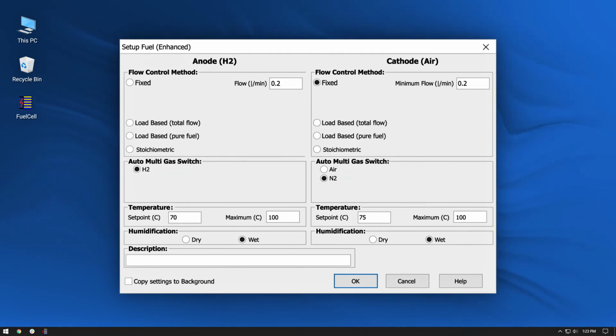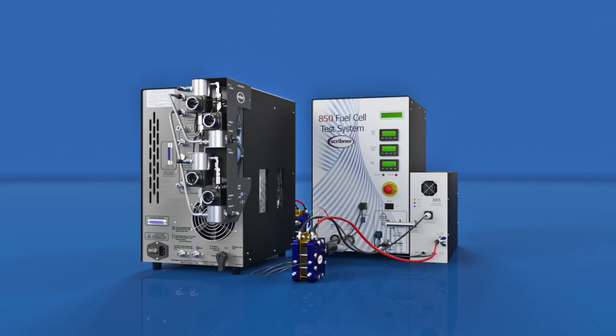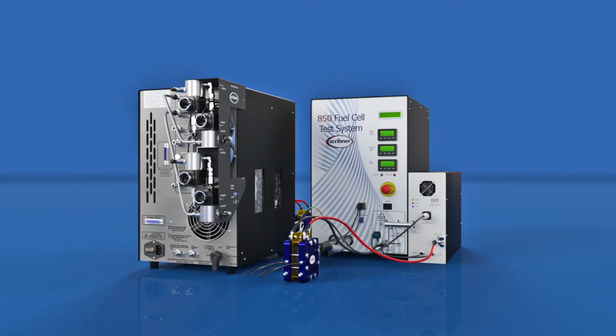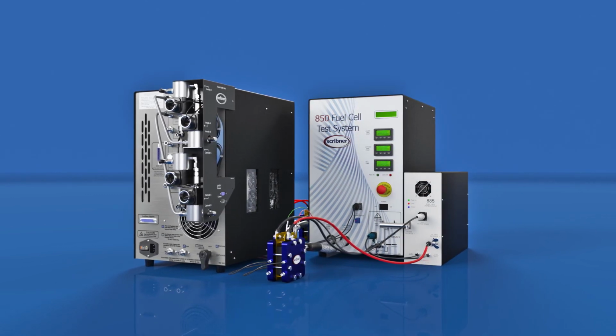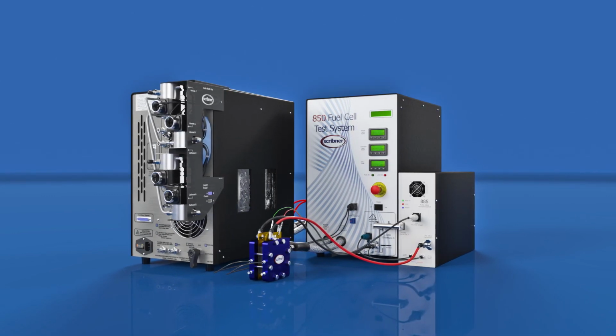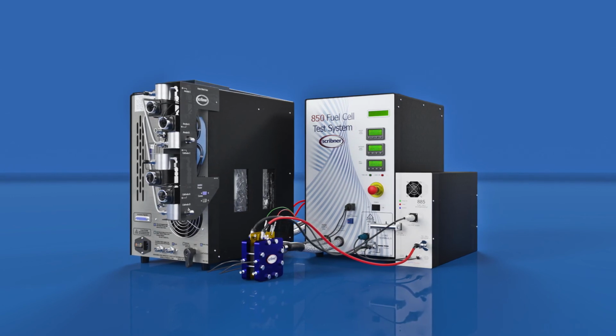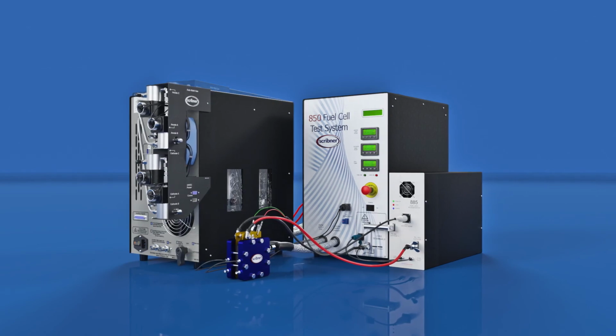Such diagnostics include in-situ measurement of the hydrogen crossover flux by linear sweep voltammetry, as well as electrochemical surface area, or ECSA, and catalyst utilization by cyclic voltammetry. An 850 fuel cell test system equipped with an auto multi-gas unit and a Scribner 885 potentiostat can now be fully automated to switch between standard fuel cell operation using hydrogen and air and the 850's load, and these common diagnostics with nitrogen replacing air on the cathode and the 885 potentiostat employed to perform the voltage sweeps.